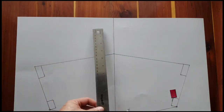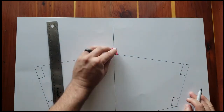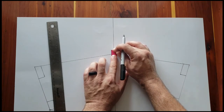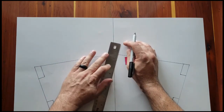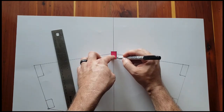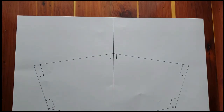We're going to do the same thing for the deck ridge — come down three quarters of an inch, mark it, center this up using the ghost line grids, then trace around the template. Measure twice, cut once. And there you go — now your chines, gunnels, keel, and deck ridge are laid out.